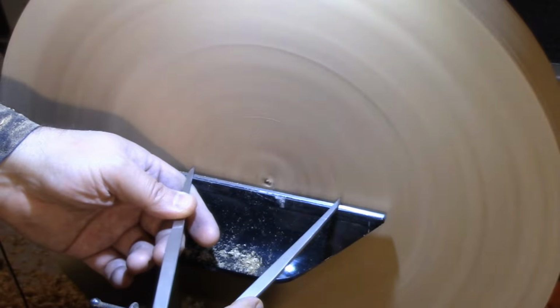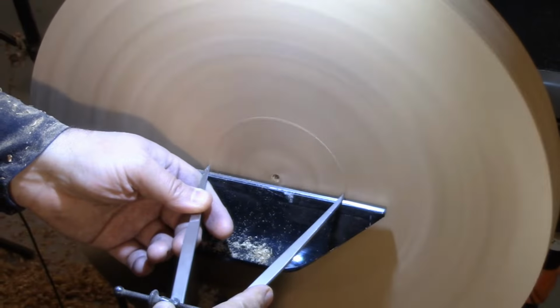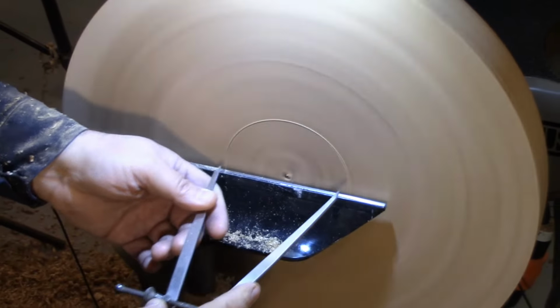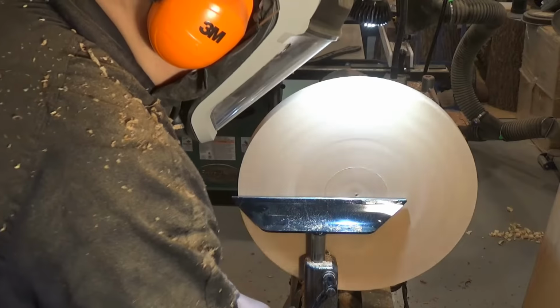I made a small groove and the right point ended up being outside of it, so I moved the left point half the difference to the outside and I try again, until the right point will point to the circumference. And then, finally, I can deepen the groove a little more, always with the left point of the divider.